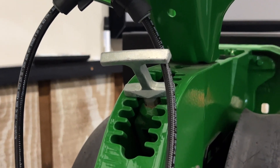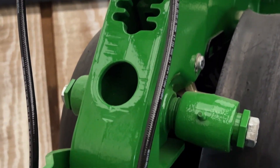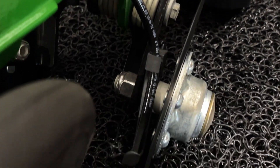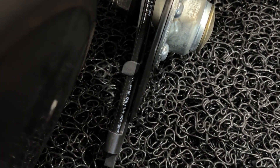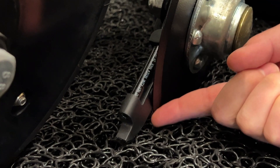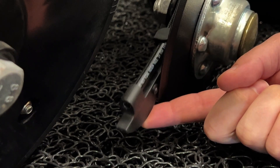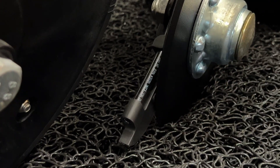We run the nitrogen through a steel-braided flexible hose that goes down into an overmolded hose guide, which directs the nitrogen downward right into the trench. It's flexible and designed so that as objects pass by, it always continues to point and direct the stream of nitrogen right into the trench.